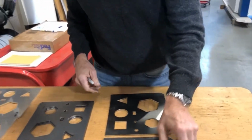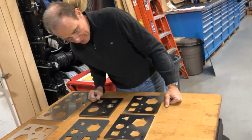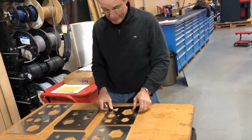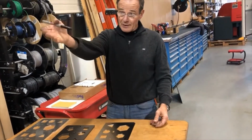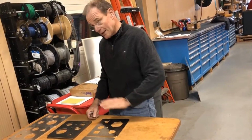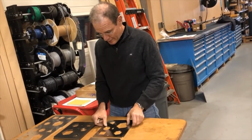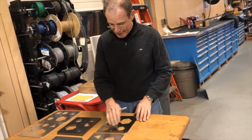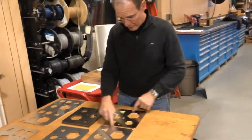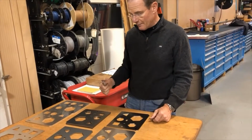These parts are not PVC covered, and the stainless steel has a very fine grain on the surface, and the customer says, what can you do not to touch that grain? Well, obviously, if you run it through a belt-driven machine, everything is going to be touched. But what we can do is run parallel to the grain, and then you can see what the results look like. This will not give us as much equal distribution between the long edges and the cross edges, but it'll still do a satisfactory job in edge rounding.